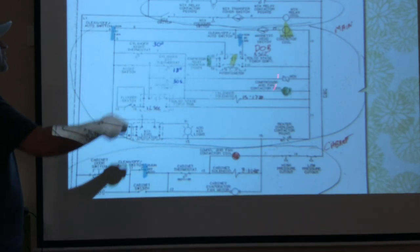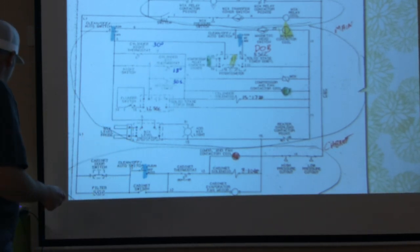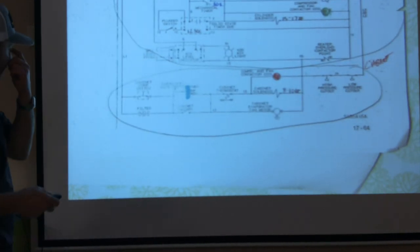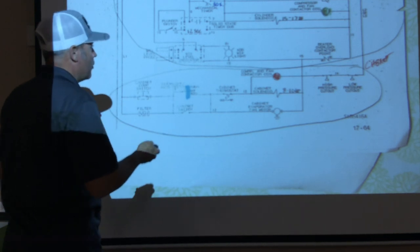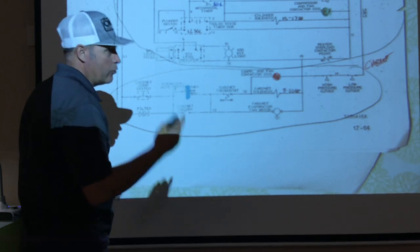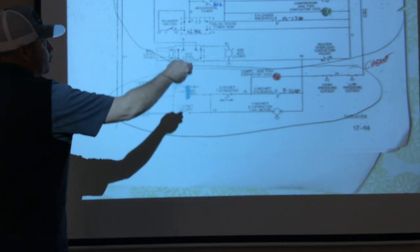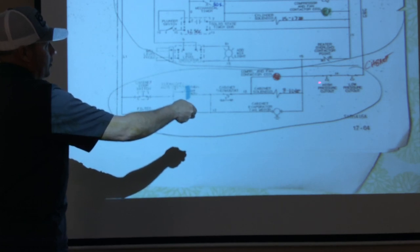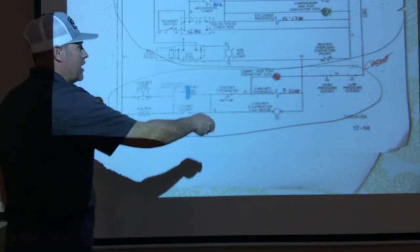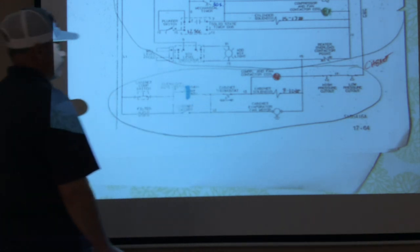That's the normal operation in daytime and nighttime mode of the ElectroFreeze. Moving to the very bottom of the machine, we have an independent cabinet refrigerator that uses the same compressor up top. We have a compressor and condenser fan contactor in red — the previous one was green — still controlling the one compressor. Notice that L2 coming in goes through a low-pressure and high-pressure control: if either one of them open, it kills L2 for the whole diagram.